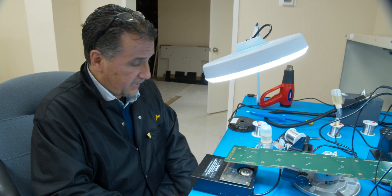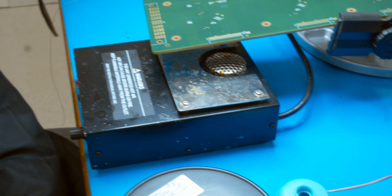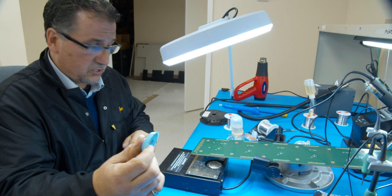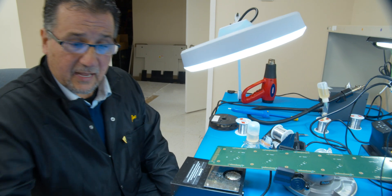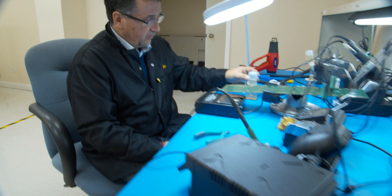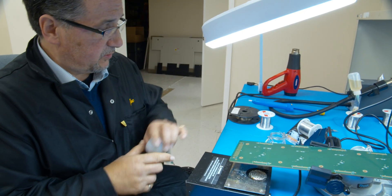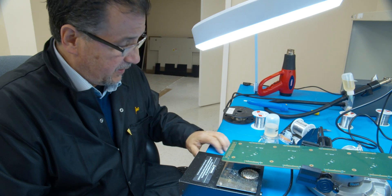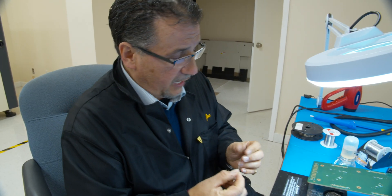With that, let's get started. I've got a hole here that's a problem to clear. I've got some number-two solder wick; I like to use some water-soluble flux. I have a JBC iron here and I have it set to about 800 degrees Fahrenheit. The first thing I'm going to do is put some flux on to this hole that I know is going to be hard to clear.